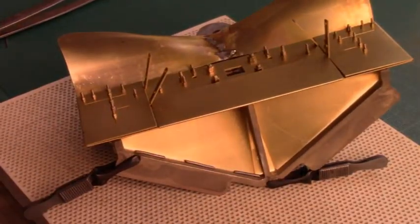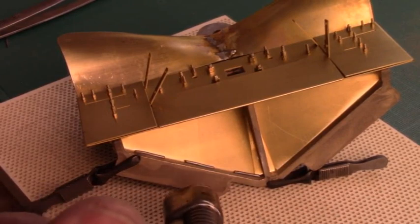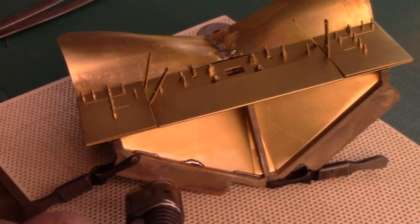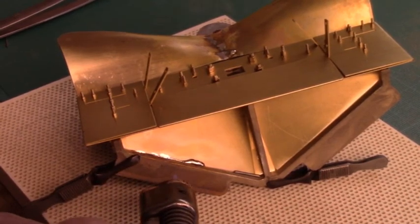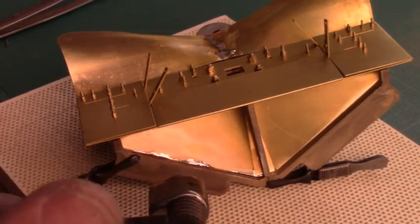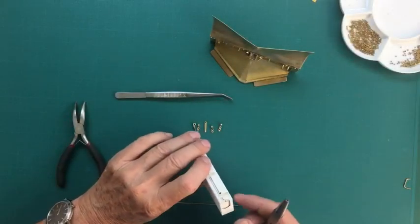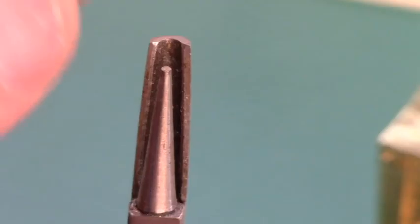It is important to heat the thicker part first and let the solder melt, not from the flame, but from the hot metal if possible. I also printed a small helper for the coupling linkage. These 3D prints are very helpful.